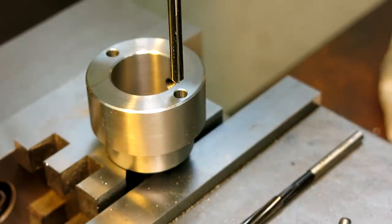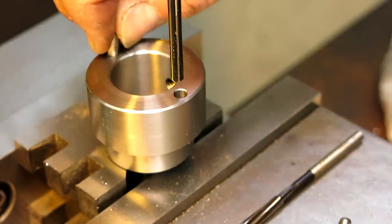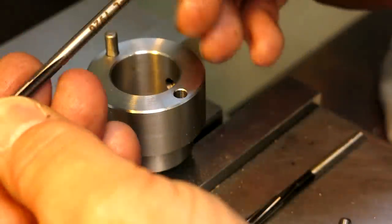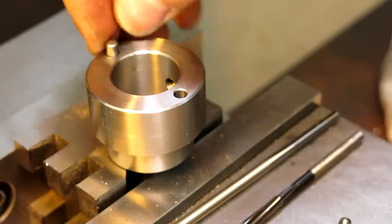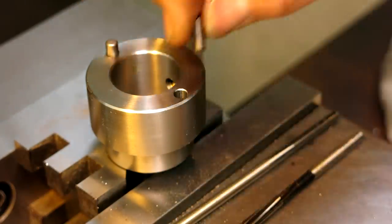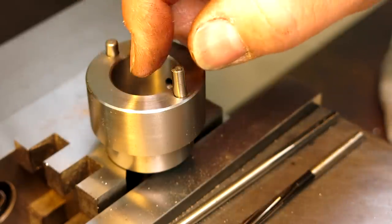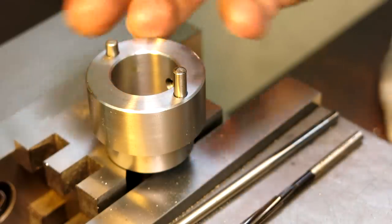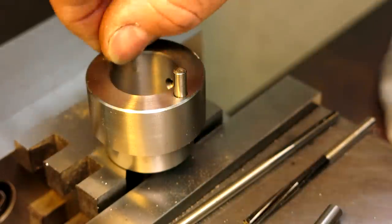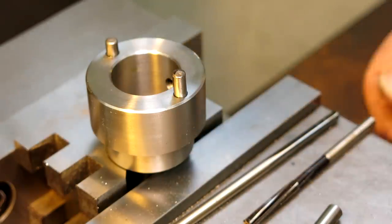So all that talking, and it's not a press fit. How do you like that? So this particular reamer is not doing its job, and it's cutting oversize. All right. Well, I'm gonna push that one in, and then I'm just gonna go with a kind of heavy press on this one. The original handle only has one pin in it anyway. I doubled up and put two, so I'm gonna just press that one in and have this one a floater. It's trapped in the assembly, so I'm not super worried about it, but I'm just annoyed that after all that talking, it reamed oversized. So join the club.